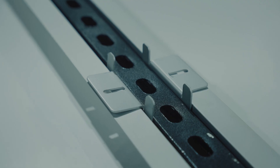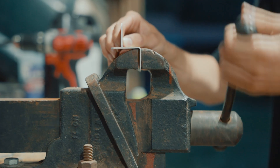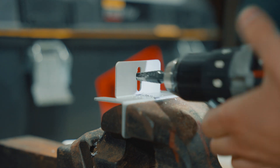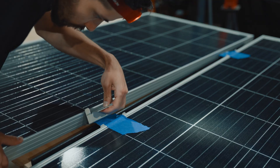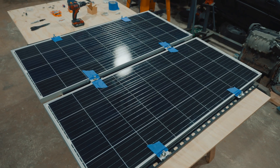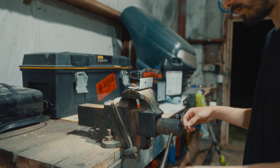Now let's take a look at our solar panels. I'm going to mount these with a bunch of z brackets, but first I have to cut some holes in the brackets for my 3/8 bolts to fit through because the holes aren't big enough on the z brackets. I used a step bit to cut those holes. Then I used a bit of tape to help line everything up, and I flipped over the solar panels and marked where I needed to drill some more holes for the z brackets to attach.